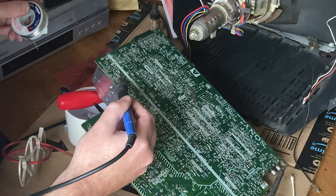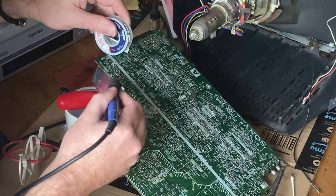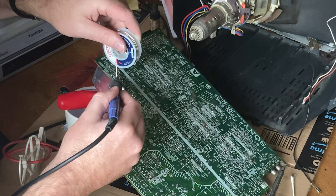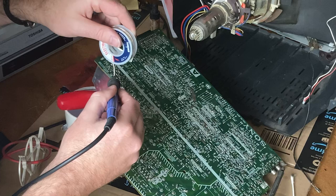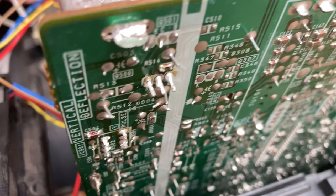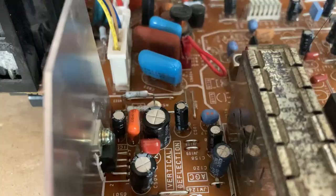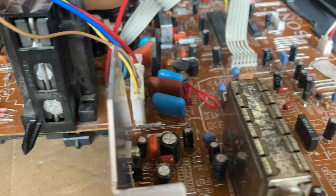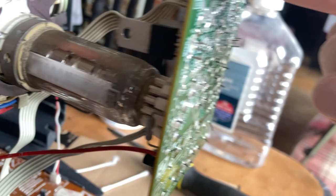Take the brand new shiny replacement and reattach it to the board — don't screw all the way in, but definitely apply thermal paste at the back for good conductivity to the heat sink and RF shield. It looked like someone had attempted a repair before, badly re-soldering it. Put all that back in, re-solder all the points using plenty of flux for a good connection on the pads. Once everything is soldered back in, do a full run across the board to make sure nothing else is outstanding — there's nothing worse than reassembling and finding you missed one small thing.